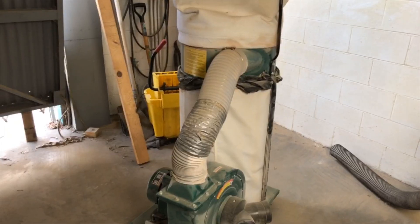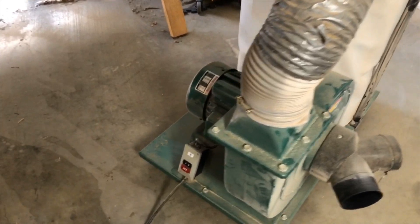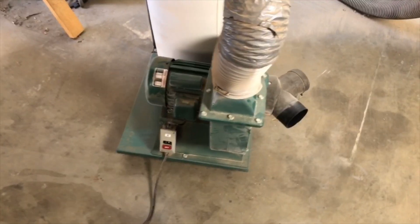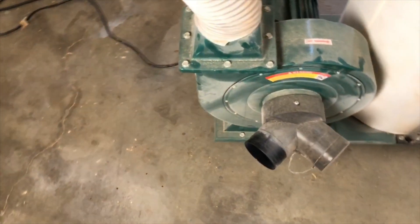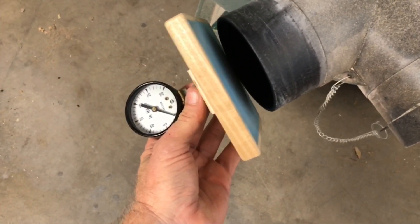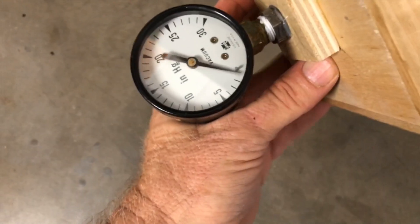Let's go over and test this machine — this is the biggest machine I have in my shop. It's got a five-inch inlet, maybe even bigger, and a three-horse motor on it. This is a serious blower, and I will tell you, it blows a ferocious amount of air, so this thing has got to be pulling a wicked vacuum. I'll just let my little gauge apparatus sit right on there — it sticks right to it. Again, significantly less than one inch of mercury.